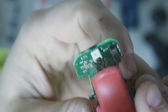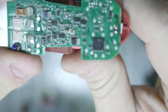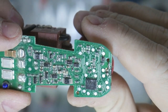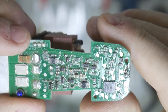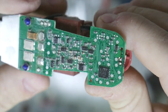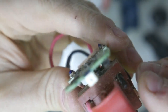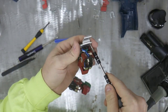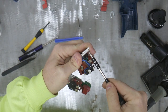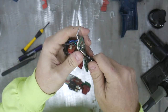I'm terrible at soldering, but I was at least able to desolder the connector on the one circuit board and the LED on the other one. Here is the bare circuit board ready to receive the connector, so I can transplant this trigger assembly into my good impact drill. I soldered that connector onto the drill circuit board — no bridging! I'm actually pretty impressed because like I said, I'm really terrible at soldering. I just need more practice, but it's in there. I believe the polarity is correct — I guess we'll find out.